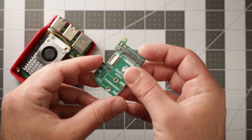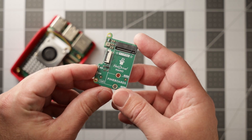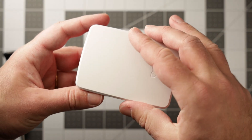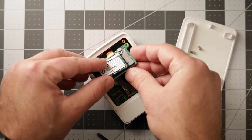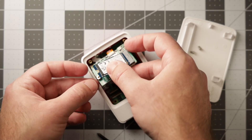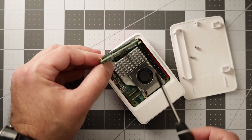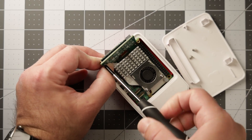Moving on to the Pine Boards Hat Drive Nano. This thing is not only tiny but retails for less than $10, making it one of the cheapest options to add an NVMe drive to the Pi 5. It's designed to fit inside the official Raspberry Pi case, leaving plenty of room for airflow and easy access to the GPIO header. All of these boards are a little fiddly to mount, but this one is particularly fiddly. You have to add the NVMe drive first because it's screwed from the back of the board, meaning there's no easy way to swap drives without unscrewing the hat, flipping it over, letting it dangle by the PCIe cable, and swapping the drive.